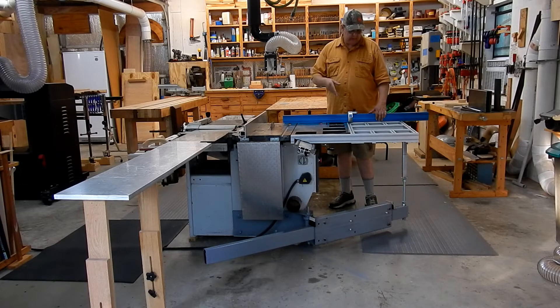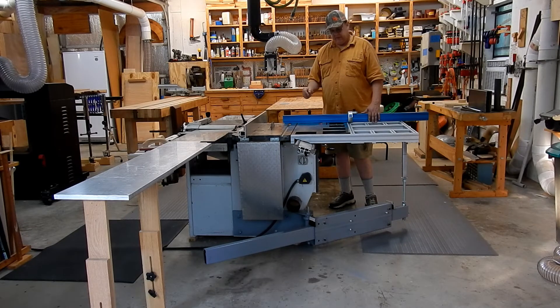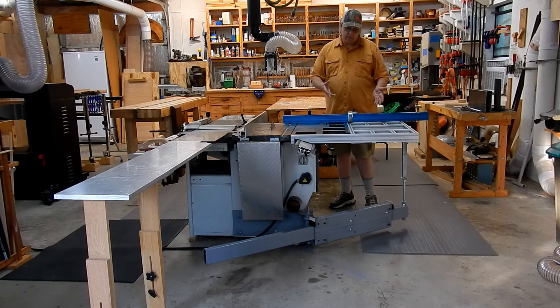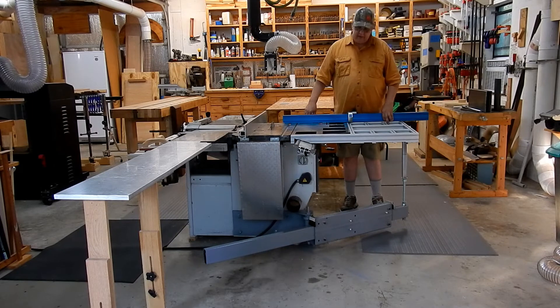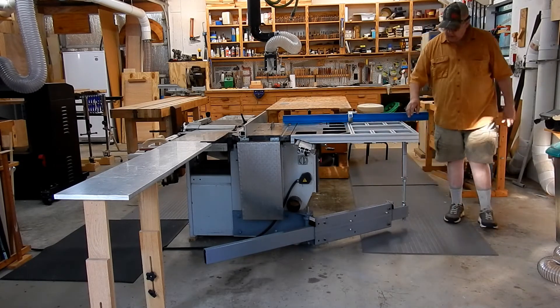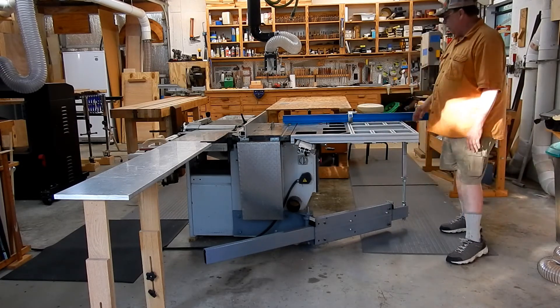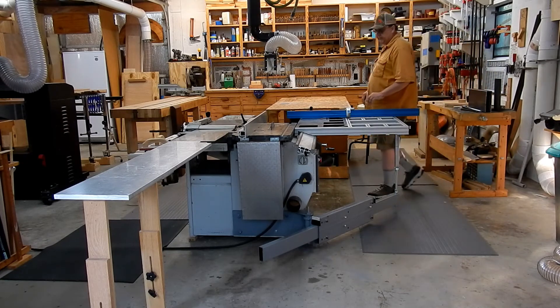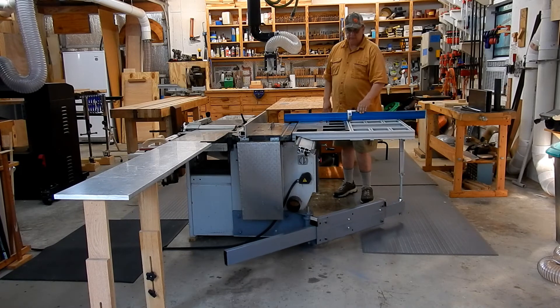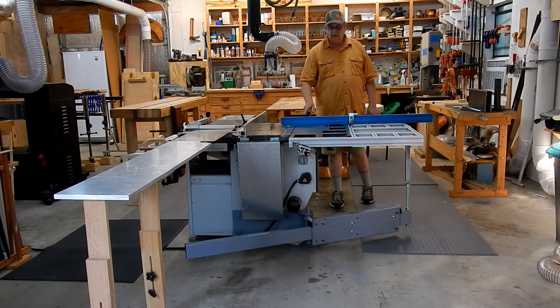I thought I'd just give a quick summary of the table support. It's a sliding support made out of 8-inch by 2-inch rectangle tubing, 11-gauge, 120-thousandth wall. At first I thought that was really going to be too heavy - I couldn't find anything thinner - but I'm glad I went with it in the long run because I think it really needs it, being almost six feet long. I did have to put a 25-thousandth shim on the top of the plate to take any dip out so it stays level all the way through the run. Everything works fine, it's not hard to push, and I'm happy with it. I wish I'd had this a long time ago. Thank you for watching, have a good day.